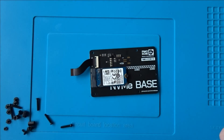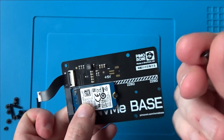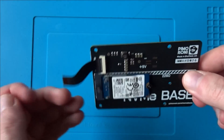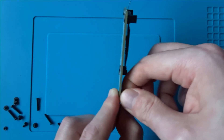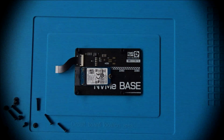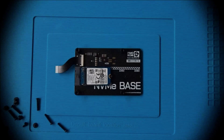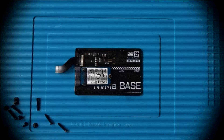The next thing to fit are the mounting posts, which will hold the Raspberry Pi above the base. For this, use the shortest screws and fit them to the mounting holes around the outside of the base. I should point out that the steps I'm doing here are in a different order to the official Pimoroni installation video. While I chose to mount the Pi next and install the cable afterwards, the Pimoroni video guide plugs the cable into the Pi first and then folds the Pi on top of the base.